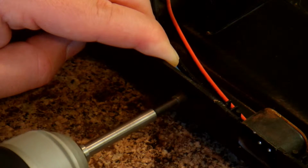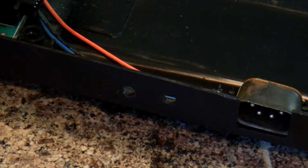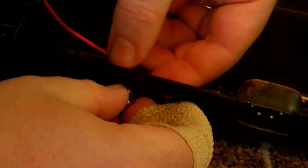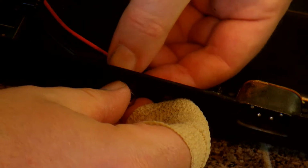Next, you want to make 2 1/4-inch holes on the back of your case by the power for the video and audio out. You want to screw these down really tight because you're going to be unplugging them and plugging them in. And you don't want it to twist because it'll actually break the solder points if they can twist too much.